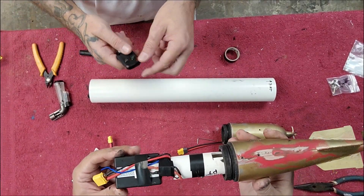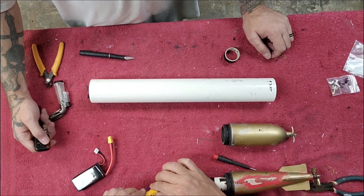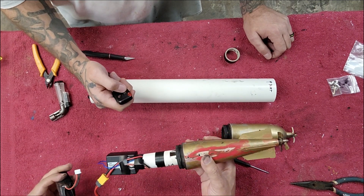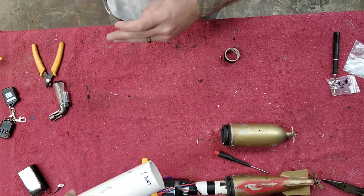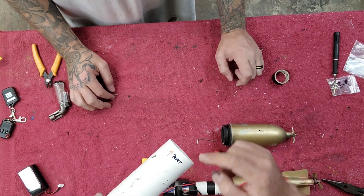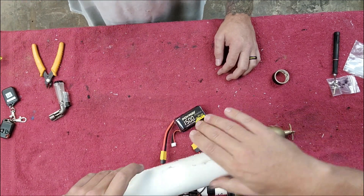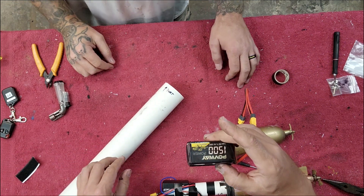Here's our tidy little assembly, and this will fit inside the tube. We've got a little wire extension made up. We can put that on and test it — put power to the switch, and when we push the button it should fire up. It turns off when we hit the button. We've already trimmed the other torpedo — we've got 290 grams of weight inside there curing, right in front of the battery, about 4 inches back from the front edge, curing in place with some RTV. Got some Velcro on the bottom of the battery so it will get stuck down and won't move inside.